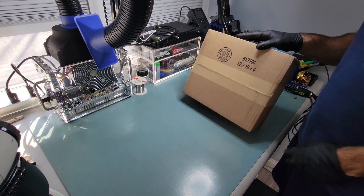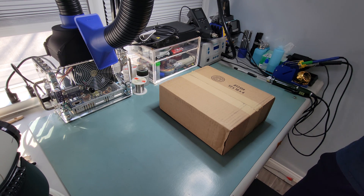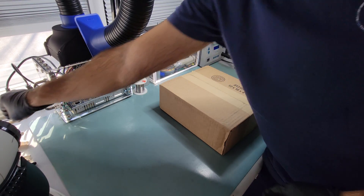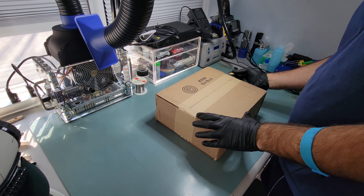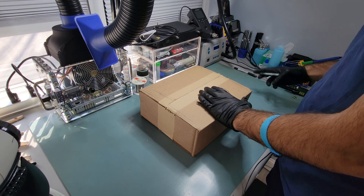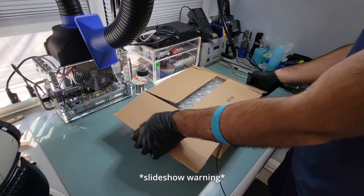I've got the board back here from Northridge Fix — haven't taken it out of the box yet — so we're going to unbox the repaired board, take a look at that connector that was repaired, and probably reinforce it. As a lot of people noted, it seems like a pretty fragile connector being surface mount with no other reinforcing features. So the first thing we're going to do after we inspect it is apply some neutral cure RTV to the board around that connector to reinforce it mechanically so that it doesn't rip off again. Just to be clear, I'm not the one who broke the connector — I received the analyzer in this condition.